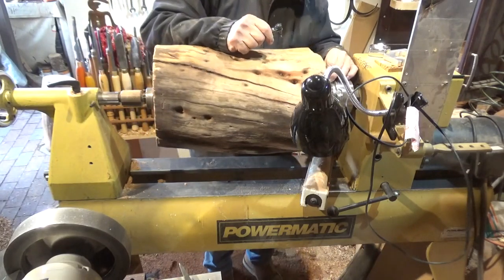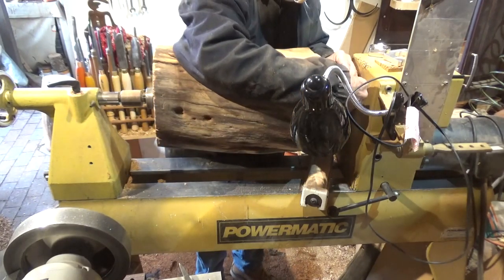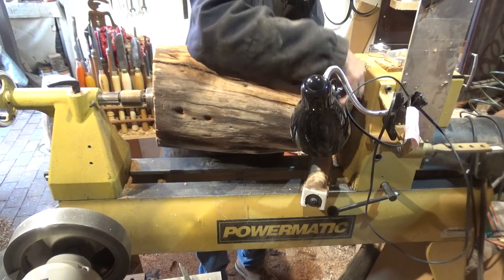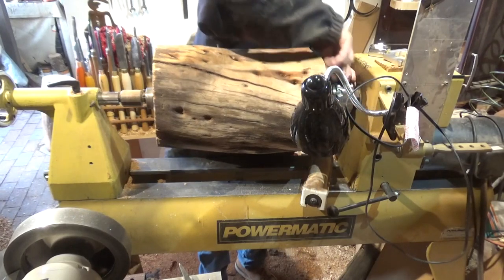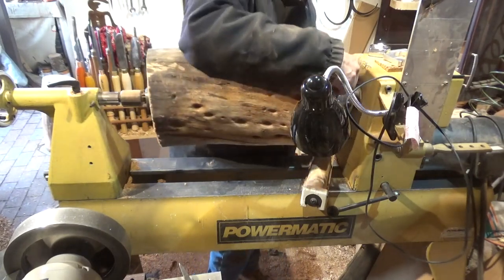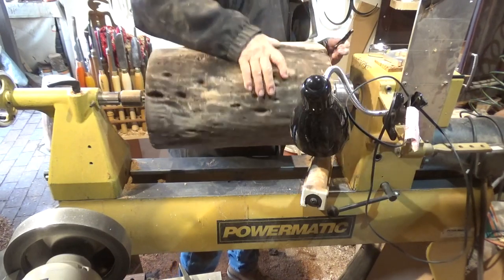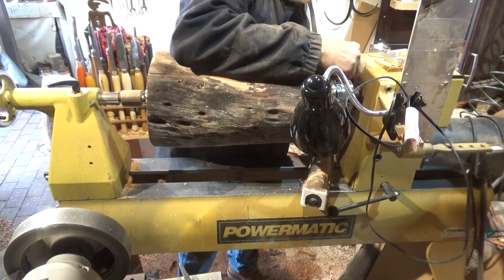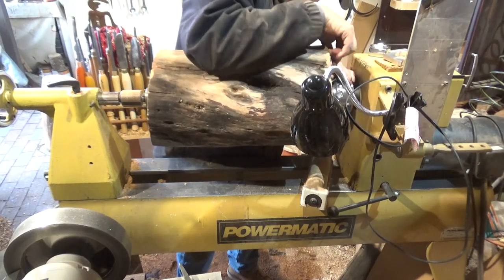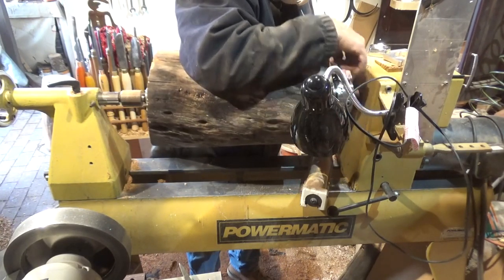All of them are in. I'm missing my number one screw on my chuck plate — it's not making contact. Number two is at a jaw split, so it does not make contact, but it will. There are a total of thirteen screws on the chuck plate. You don't need thirteen — you really only need about four, as long as they're on the three-and-a-half inch outer ring of screws. Right now I think I'll have about nine screws making contact helping me out.